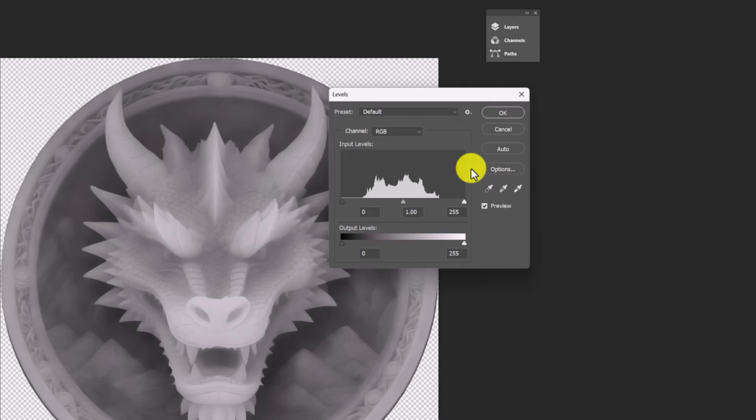And there is no data being shown at the far right-hand side of our graph, which is the top areas of our coin engraving. That tells me right away that a lot of the depth is going to be buried, which is exactly why we had to engrave so many layers before anything showed up. Those layers are part of your depth budget. If the histogram is narrow like this, you're spending that budget just lowering the surface evenly instead of creating any kind of detail. Ideally, I want to see the histogram reach much closer to both ends of this chart. It doesn't have to be perfect, and it doesn't have to be a flat graph, but it shouldn't be trapped in the middle like this. When a depth map looks like this, I usually call it a muddy depth map — not because the art is bad, but because the depth information is so compressed.